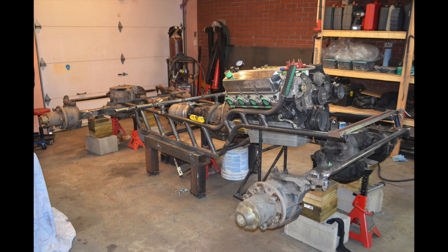The main subframe is completed and I positioned it on the welding chassis at the right height set earlier. This might sound silly, but I like to position the seats first. A lot of other builders don't like to do that, but I do it for a couple of reasons. The seats, after the drivetrain and axles, are the biggest items going inside the buggy, and you want them to be as comfortable as possible. You need to set the position of the seats as well as you can.